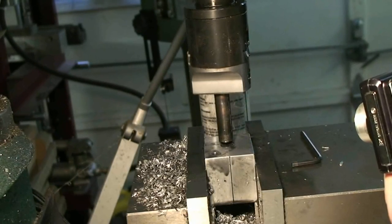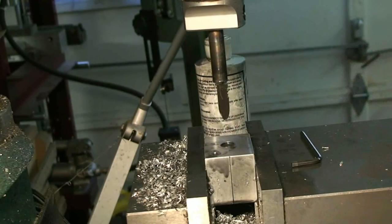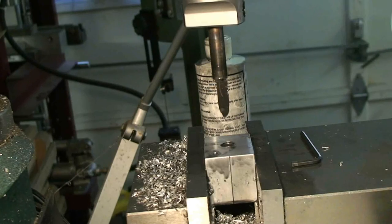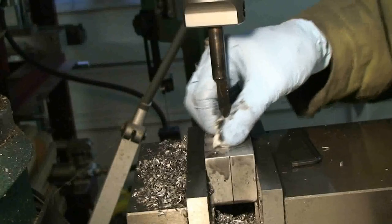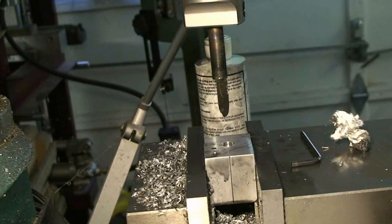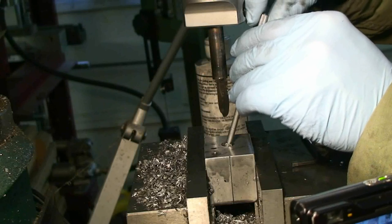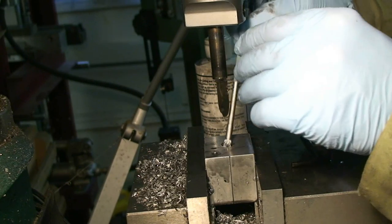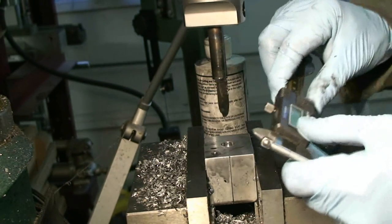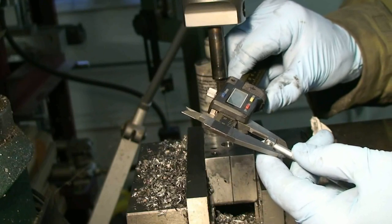Okay, unlock the spindle, bring it up. Take a piece of paper towel and clean out the cavity of the mold. Now I'll use an expanding T-gauge to measure. As long as the base of the bullet mold is perfect, I can lap out the nose if the cutter didn't get the nose perfect. I know the first mold I made — it didn't make it perfect — and I lapped it out a little bit. 467. Okay.